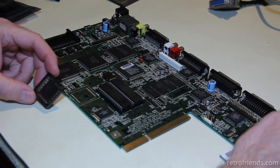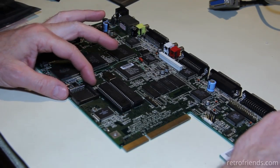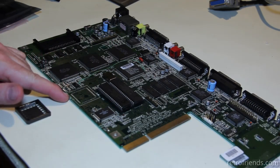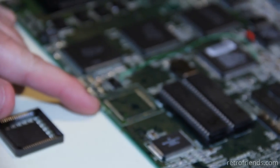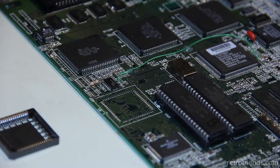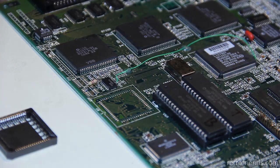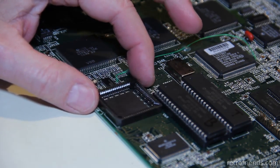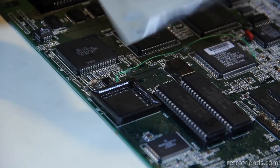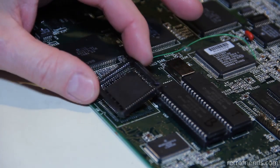So he bought the surface mount style socket to go in here. This is the spot where there's an empty spot for a floating point unit, and you can decide to just solder the chip directly on there, or you can put a socket, which everybody always prefers. It's a good thing you bought two, because you never know, sometimes you get a bad one, so I'll be able to swap those out easily if we have a problem.